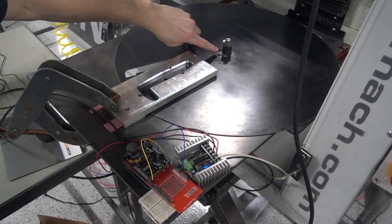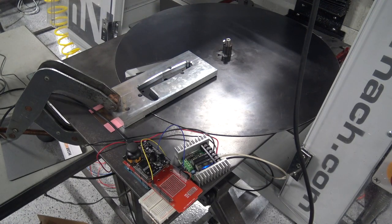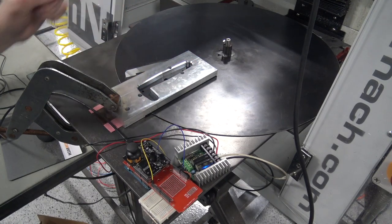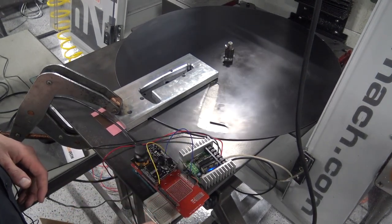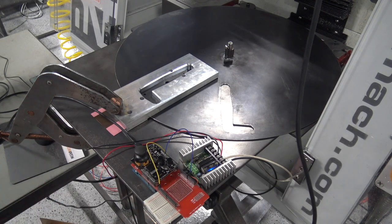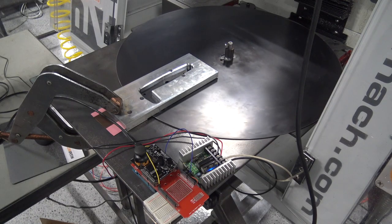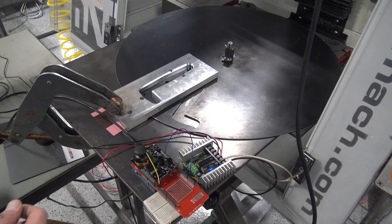Couple problems. I know that my coupler here stinks, but I don't actually think that's the problem. The problem is this transfer between the storage rack vertical and dropping into this slot. So if I hit forward, it skips over it if I'm too fast. Slow it down and I start to lose motor power. So actually skipped over there — I think I probably lost tram.